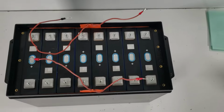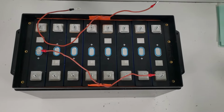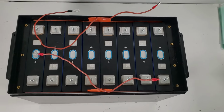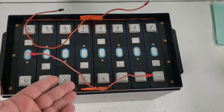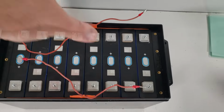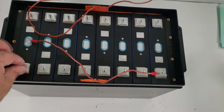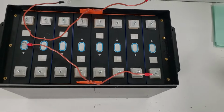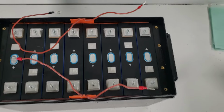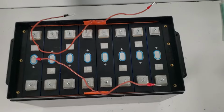So we've inserted the cells. And like I said, when you get the V5 24 volt kit, this step has already been done. We've already installed the plate, but we want to show you the process of how we do it. We create the pack, attach the heating pads, and then insert the entire assembly with the proper foam compression already in there. It's very stout. It will not move. When we put on the top bracket, it's essentially going to be cemented into place almost. So the next step we're going to show you is the way that you will actually receive it.